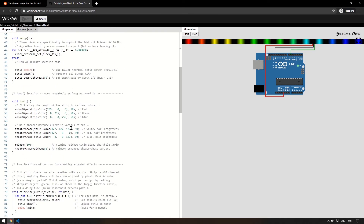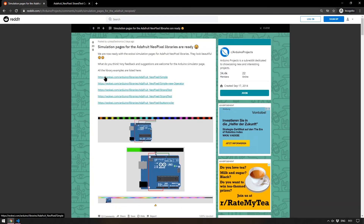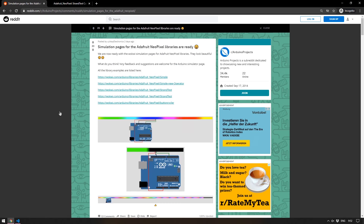Whether you're using the Adafruit NeoPixel library or FastLED, all of this will be somewhat familiar — you make your own functions and call them from loop to do various things. But it's not necessarily easy unless you've got a dedicated spot to leave an Arduino and LED strip set up. Being able to get a bunch of debugging done using a simulation is kind of huge, and anyone wanting to set up addressable LEDs for their smart home or just for fun will get a lot of use out of this. The maker is in the Reddit comments answering questions — I'll link the thread in the description.